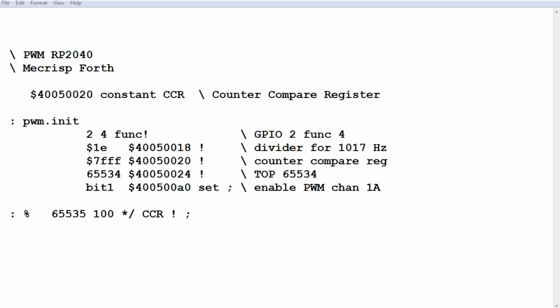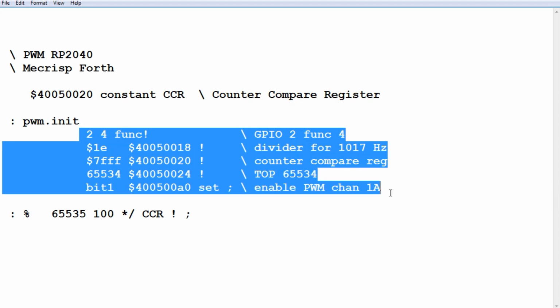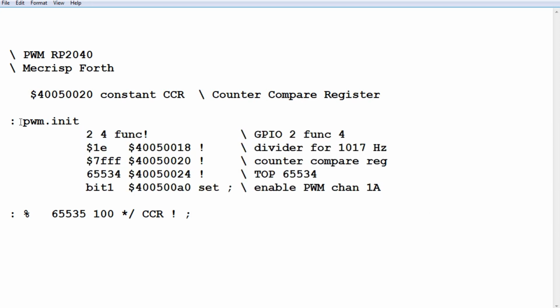Okay, here's the code running on the RP2040 microcontroller to set up a PWM channel on GPIO pin 2, and it's written in Mecrisp Forth. We're going to do some direct register programming, so we'll get into the internals of this microcontroller. There are 5 things we have to do to set up the PWM channel. When I run the word pwm.init, it's going to run these 5 things, and we'll set up our channel. The first thing we do, we set up GPIO pin 2 as our output. So we set up pin 2 as function 4. That's what the first line does.